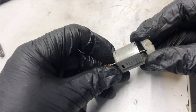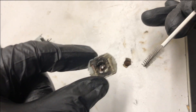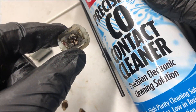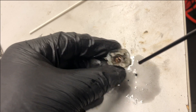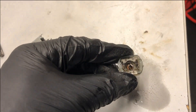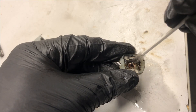There we go. I like these because they're nice little gentle ones. Hopefully you can get some that have been thrown out, otherwise you'll find something in your drawer. I'm also using contact cleaner. You don't want to be using brake cleaner or something like that. This is just cleaning away a lot of that — see, it's disappearing, ending up on the bench. Get that a little clean. Doesn't take much — it's just accumulated. All that dust, it's got nowhere to go.